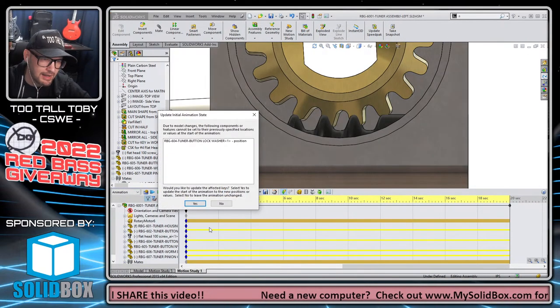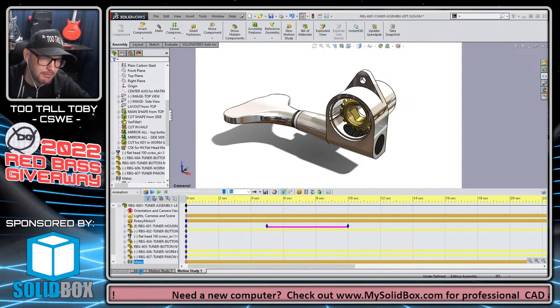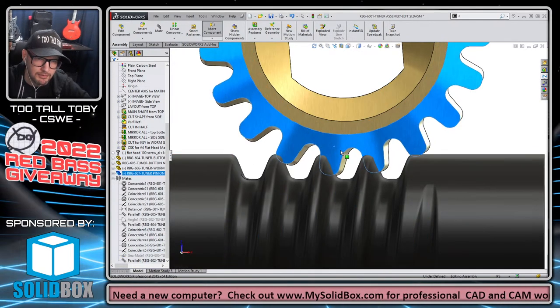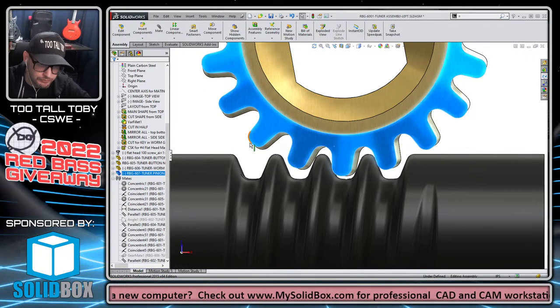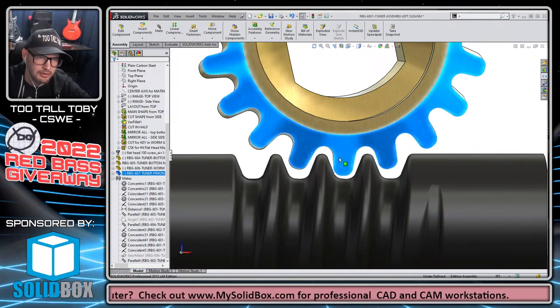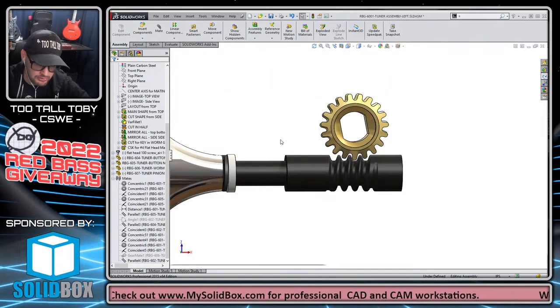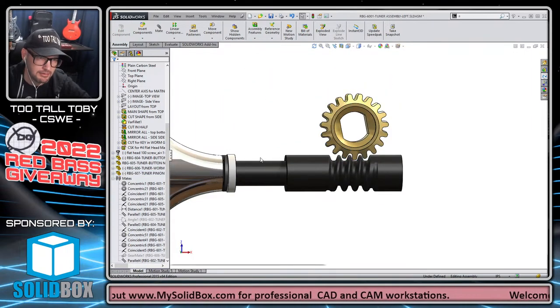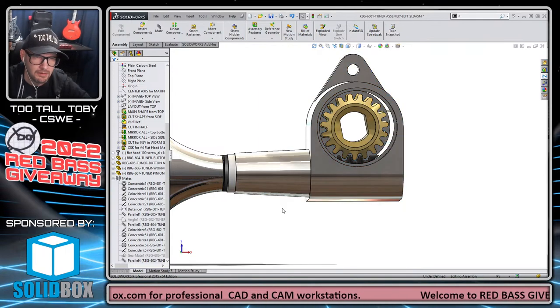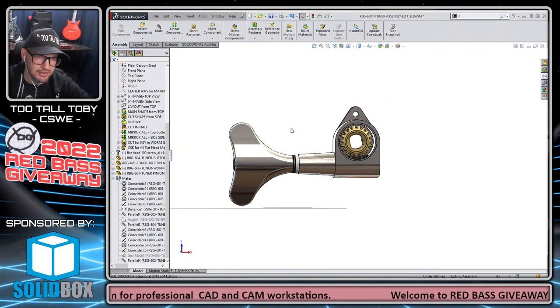I'm going to delete the other one that I created a moment ago. It says, do you want to update the initial animation state on this one? I'm going to say no. I'm going to return to my assembly. I'm going to suppress that gear mate. I'm going to move this guy into place here. Again, it might be good to look at this from an end view, something like this. Move that guy into place. And then I'm going to shift tab to show the housing. There we go. And now the housing is shown as well.